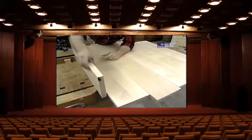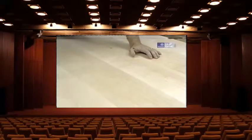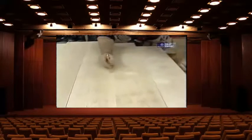When I went down to my hardwood outlet, I was very fortunate to find he had some nice 5/4 by 8 maple. Now, what I've done is cut some boards, paying attention to a couple things. The growth rings, they curve up and then down alternately, and that'll give me a more stable top. And also the texture. I want the top to look as much like one piece as possible when it's all glued up. Once I've laid out the boards to that point, I can mark them just with some slash marks. And this will keep the boards in the right orientation through the next few steps.